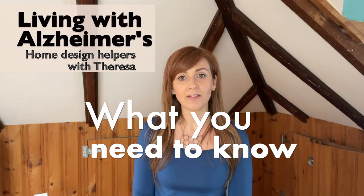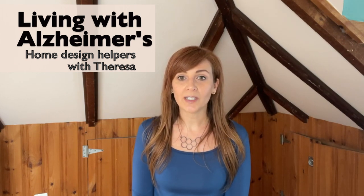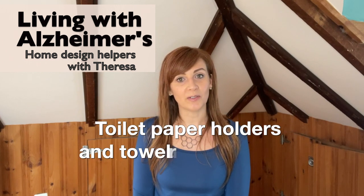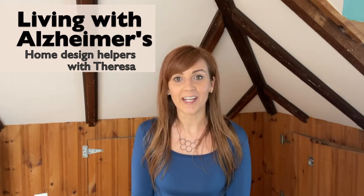So what do you need to know about toilet safety? Well, it has a lot to do with grab bars. If you've ever had an injury that made it difficult to rise from a toilet, you know that you're ready to grab on pretty much anything around you to help out. This can lead to using the toilet paper holder or a towel rack as a grab bar or assist bar. Neither should be used as a grab bar. While they're shaped similarly, they aren't attached to the wall as securely and aren't designed for the weight of a person. Holding up a roll of toilet paper requires way less structural integrity than what's needed to hold up a hundred and eighty pound person.